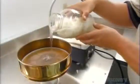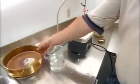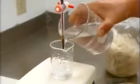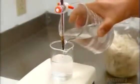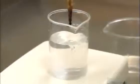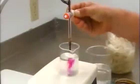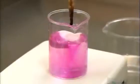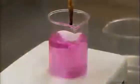Back at the processing factory, feathers go through the same post-washing tests that down undergoes. To measure cleanliness, lab technicians soak a sample from each batch in distilled water. Then they strain the water, mix it with sulfuric acid, then add a potassium compound. Then they analyze the color of the liquid to gauge its oxygen content. If the oxygen level's under 10, the feathers are clean enough to ship to the duvet factory.